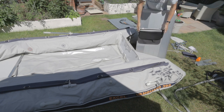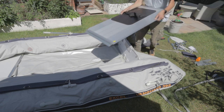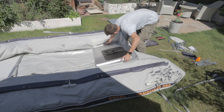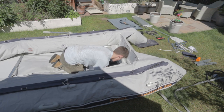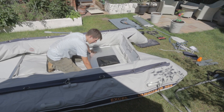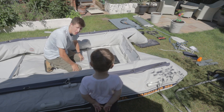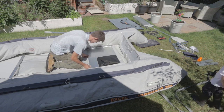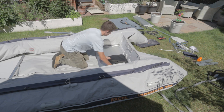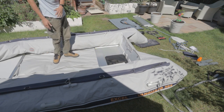The rear board has the fuel tank strap on it. Number five's on that one and points forwards, so you can read it when looking up the boat. Put one side in first — just be mindful of the sharp edges — and you'll also see these clips so the board needs to go underneath them. There you go, the board's under those clips, nice and up against the edge. Boards two, four, and three slot in slightly differently.